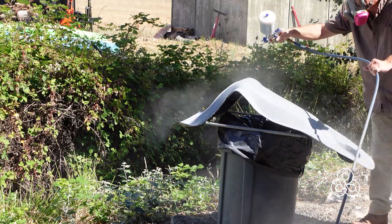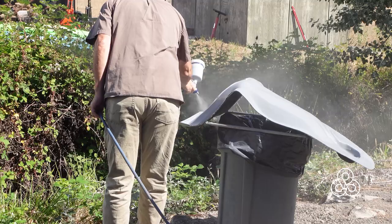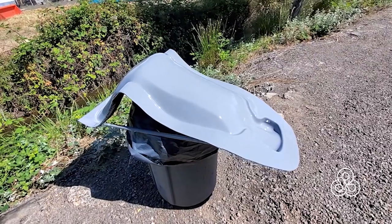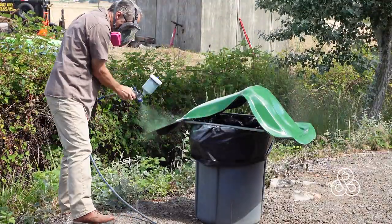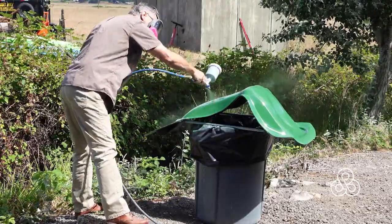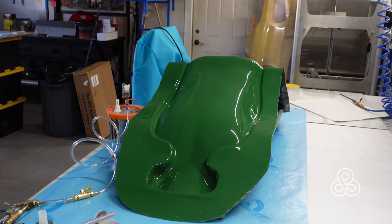What I decided to do is get some automotive finish — put a really nice coat of high-build primer on. All of the high-build primer came out looking nice and glossy and clean itself. Did a little quick sand on that and then came back and put a single-stage automotive paint on it. Automotive paint is fantastic for creating a good mold surface — nice hard surface — and it bonds really, really well. So we get this thing coated and then back in, we have a nice glossy mold ready to go. Well, there you have us building a mold so that we can make some seats. I'm going to put a link up here that will take you to another video that will show you the actual fabrication of those seats. So jump on over and let's take a look at those as well.